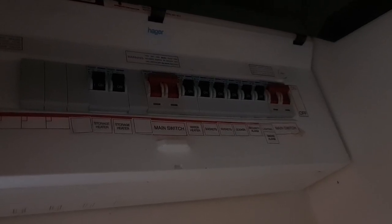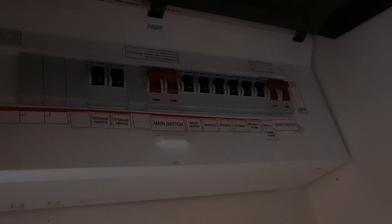The main supply to this, it's a block of flats, so there's a communal riser cupboard with a meter and isolator in, and that's where I locked off to make sure this was all dead when we've been doing safe isolation in the EICR. So that's good. I can lock off that switch out there. I've then got the key to the riser cupboard as well. And the installation is left totally safe from interference from anybody else. So I can have all these open rather than off, they were open.